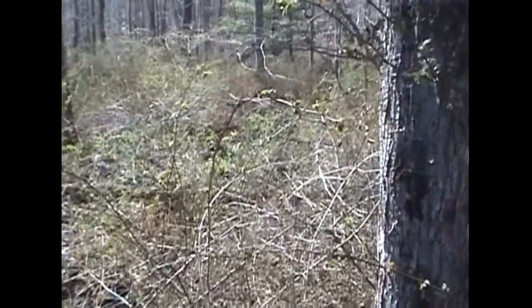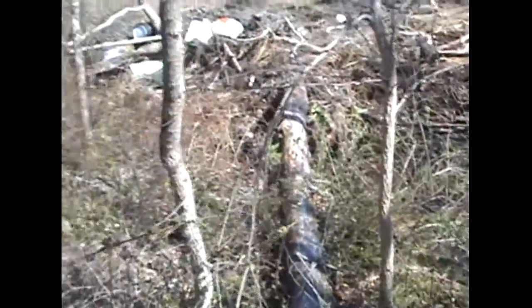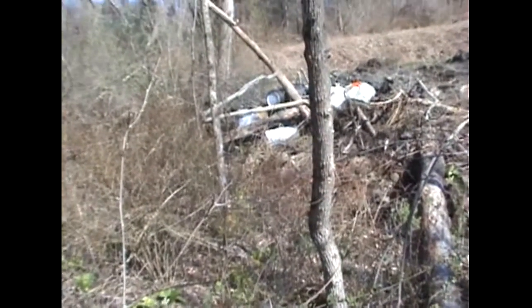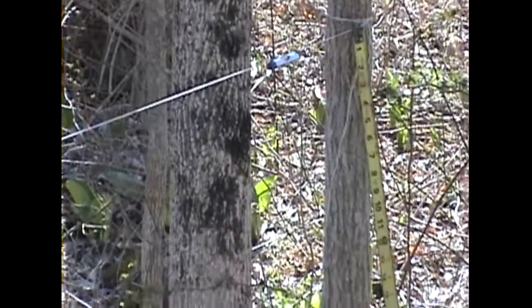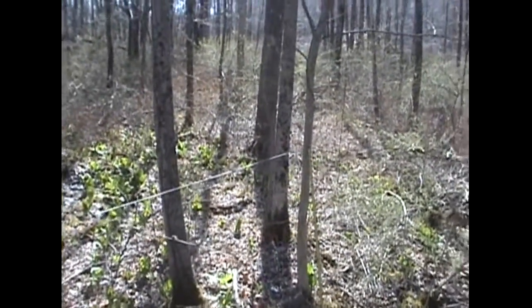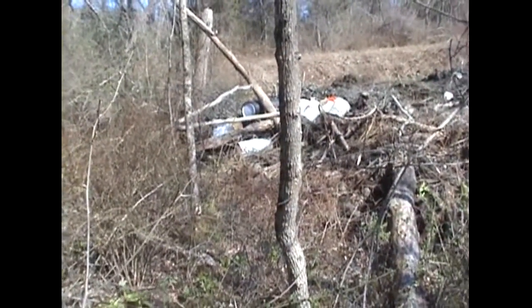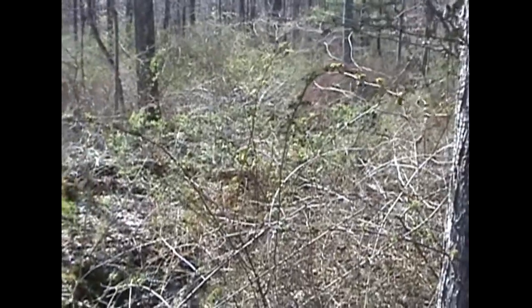I really want to have a minimum six-foot drop, so I'm going to string another line further this way and see if I can pick up a few more inches, then figure out whether that makes sense pipe-wise. Right now this line is perfectly level from the water level on the pipe — I used a line level to level the line so I could figure out what the elevation drop is. It's 70 inches, and I also did a recalc on flow — looks like we're flowing about 15 gallons a minute today.